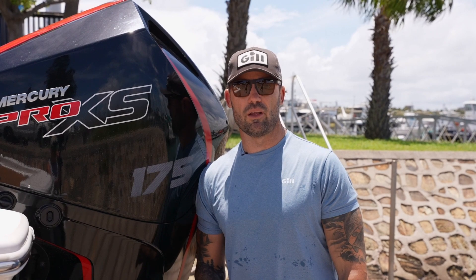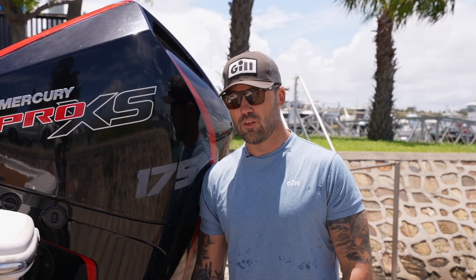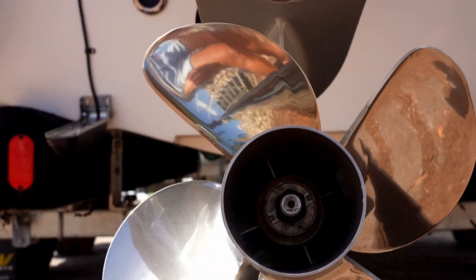When I took my boat out for its initial run, fuel economy was amazing, as I had asked for. The one drama I did have — being a bay boat with little to no dead rise — I couldn't keep the nose down unless I was going relatively fast, particularly too fast for the ocean conditions I was in. I invested in trim tabs, but locking them down to keep my nose down decreased my fuel economy. What I eventually learned was that the prop installed was a bow lift prop, designed to lift the bow — the last thing I needed on a bay boat with no dead rise.